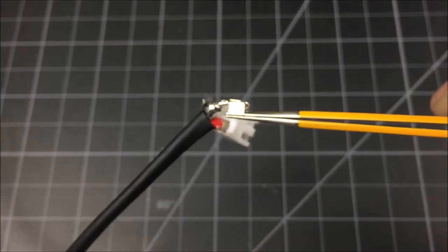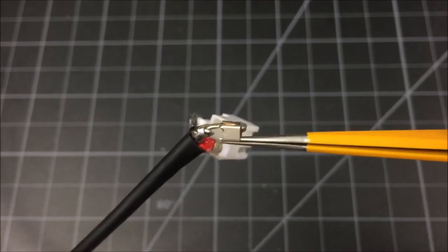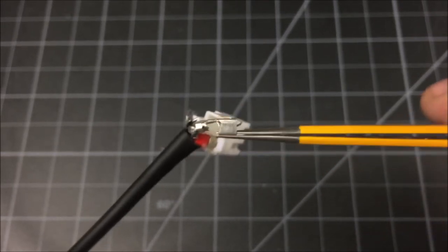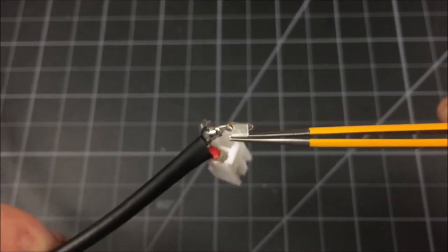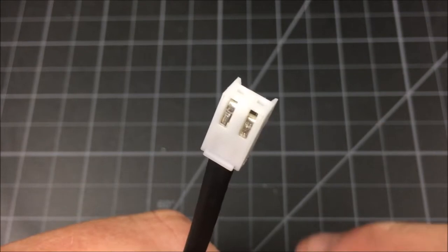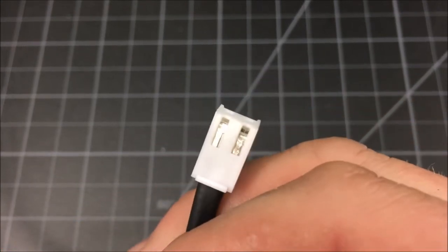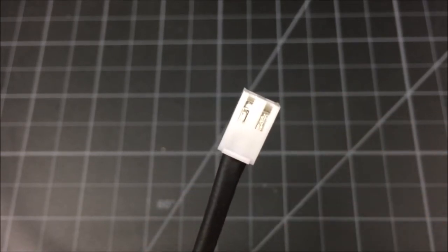I backed the wire out of the connector — the connection pin. Turns out it was upside down inside the housing. The part that was supposed to be facing down was 180 degrees opposite — the little fin on top of this metal piece was upside down. Now I've got to install it the proper way. This is what it's supposed to look like if put together properly. You can see now both pins are engaged so that the wires can't back out when they're plugged into the unit.